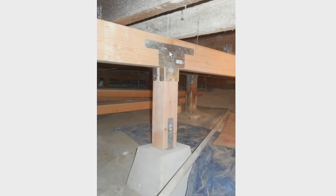So they'll put this piece of steel here and this piece of steel here. Sometimes they'll even put new concrete here. Now this is all a complete waste of money. There have been no damage because of this connection being weak in previous earthquakes — none. None of the existing seismic retrofit guidelines, of which there are five, recommend doing anything here. This is a case of an engineer or contractor making up what they believe is going to be a failure mode.